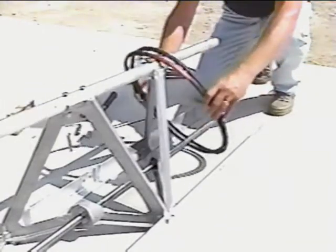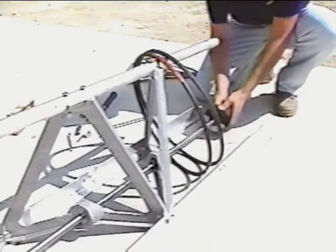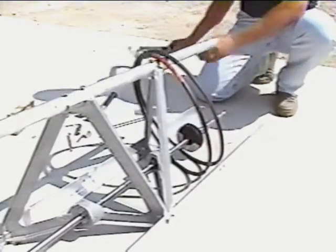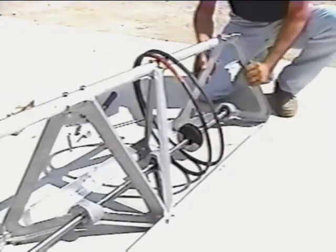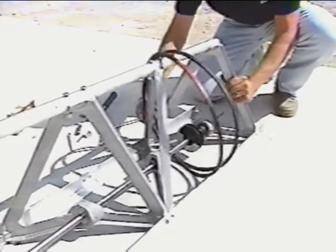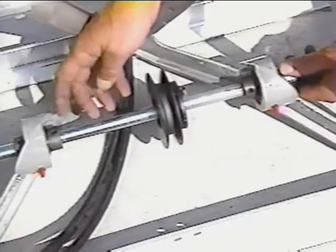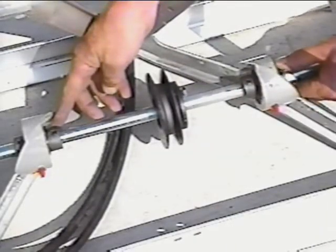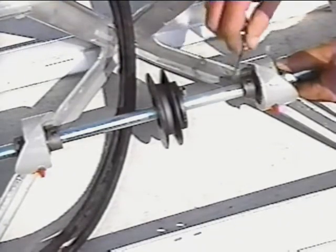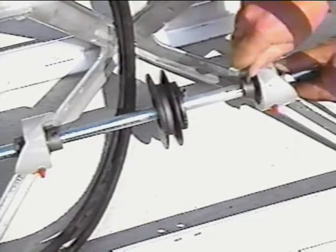Thread 2 drive belts into place. It is very important to remember that the drive pulley should be between 2 A-frames which contain bearings. Slide the A-frame back to its original position and bolt into place using only the bottom bolts. Retighten the set screws using the original set screw marks in the shaft to ensure shaft and bearing hub alignment.